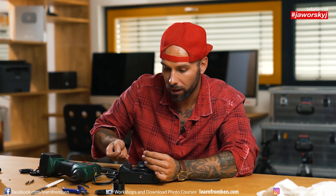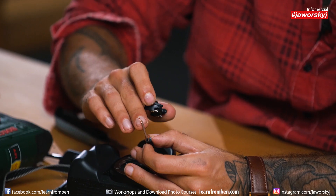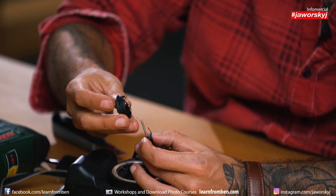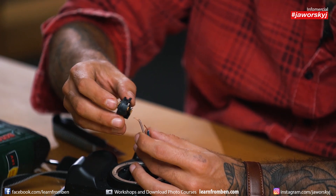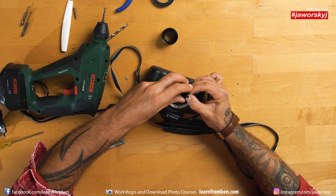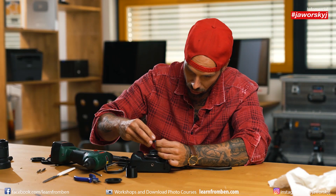I thread everything through the camera — that fits perfectly, the easy part. Now I have to attach the cables to the E27 socket. In Germany, the blue cable is the outer neutral side with no live electricity, and the brown cable is the live one. The brown live cable goes into the middle or right terminal. I plug them in and tighten each with a little screw.